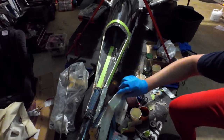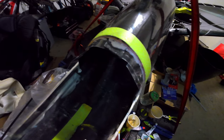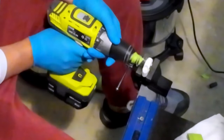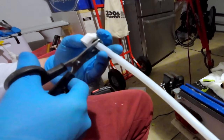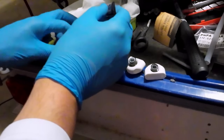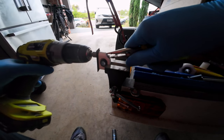Next I had to figure out how I was going to support the pushrod as it came through the boat. On my previous boat I had a tube that went the whole way from the front to the centerboard, but since I was doing so many turns and different levers, I thought it would be interesting to have less surface area in contact with the pushrod to reduce friction, and also to use up what I cut out of the other boat. So I got some little fairleads that you see on dinghies and trailer sailors, got a cheap step drill from Bunnings and drilled them out so the ID of the fairlead matched the OD of the carbon tube I cut out of the Hungry Tiger. Then I super-glued that into the fairlead, got the Teflon tube I'd also pulled out of the Hungry Tiger, and super-glued that inside the carbon tube. From there I was able to bolt these onto 3D printed bases I'd made on Fusion 360.